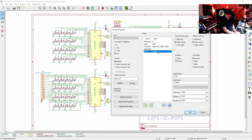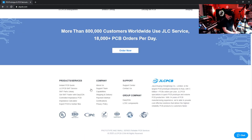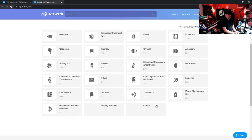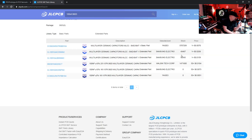To find this LCSC number, go to the JLCPCB.com website, scroll down and you'll see a link for SMT Parts Library. Click that and you'll see a search bar. For our capacitor — 100 nanofarads — we'll put '100nF' and our footprint size '0603'. Here are all the matching parts they have. There are a couple of parameters to be aware of: first, the stock. You want to make sure your part is in stock — these first four are in stock, these last two are not.